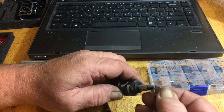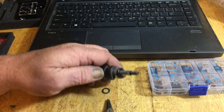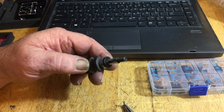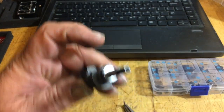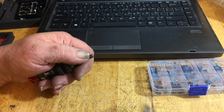This is supposed to go on the outside, I guess, before the pin goes in. Yes, it does. See, I'm still learning too, guys. We'll take the pin over here. We'll put this shim, which fits perfectly over the crankshaft. There's only one in the kit. Then we'll put the pin in. There, now we're ready for the flywheel.